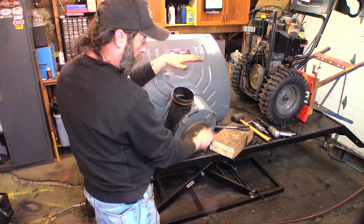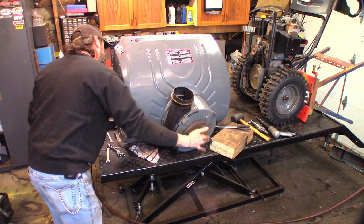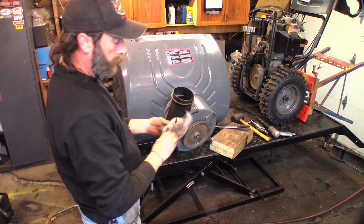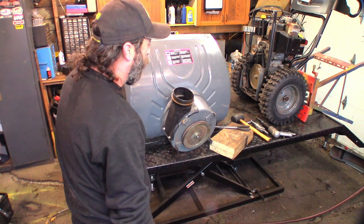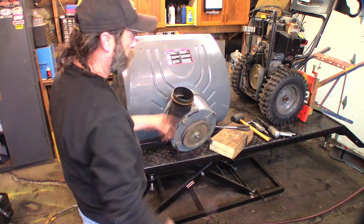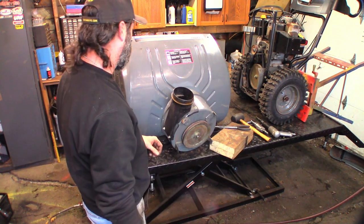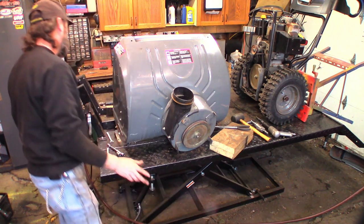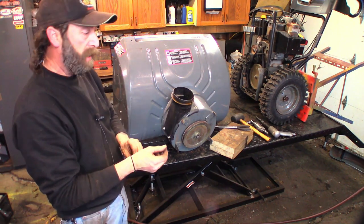The impeller's spinning and the augers are turning. I've already replaced the shear pins - I actually put real shear pins in instead of bolts. Just got to put it back together - it'll hook in here, spin around, hook on that bottom shaft, then tip it up, put a bolt here and there, make sure they're tight. We're not going to change the belt because it's like brand new. If it was a little bit old and cracked I would put a new one in just so I don't have to do it next year for the customer.